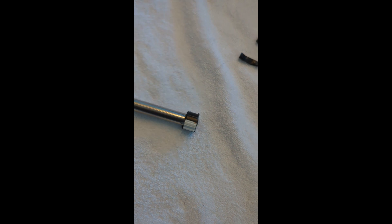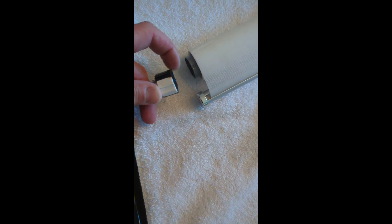After a couple of attempts, I'm trying something different. When I wrapped the tape around the circumference, the leading edge would get caught on the edge of the tube and make a mess. So instead I'm applying the tape lengthwise, leaving the two groove sides free to fit into the grooves in the tube — that way the tube edge slides across the tape without catching.